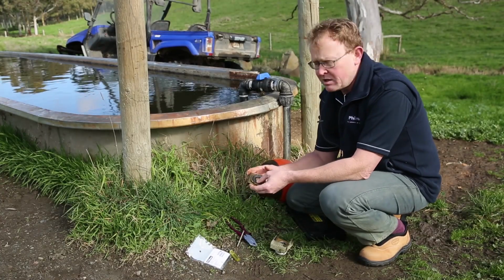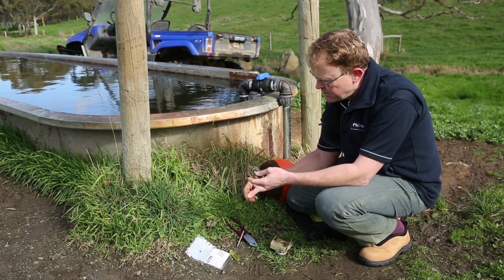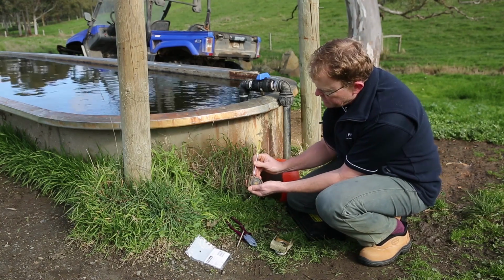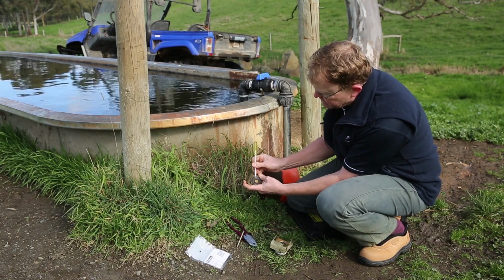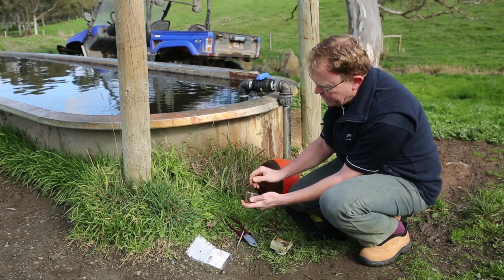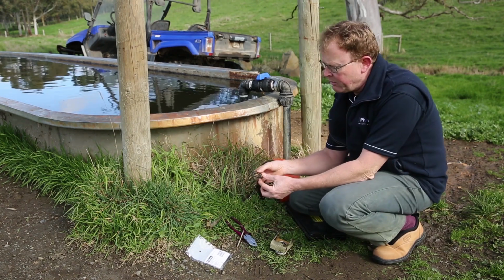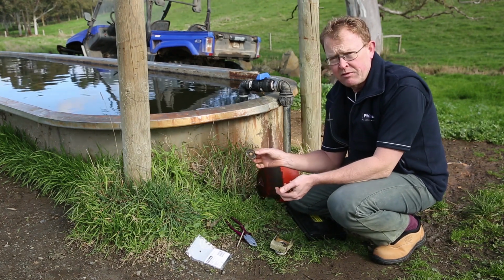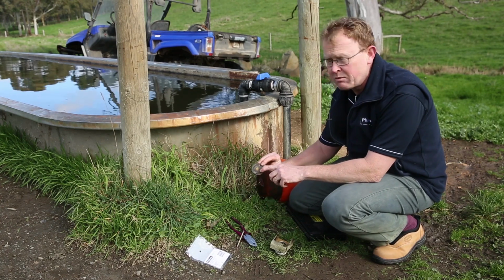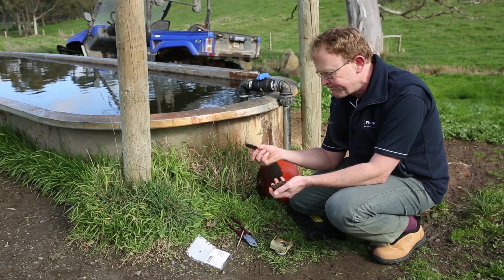In terms of the seal itself, you can see there it's kept inside this housing here. Very simple to remove. Simply a question of taking a screwdriver, and you can see there I actually get in under the seal itself, just waggle that in and lift it up there and simply remove it. Now we can do one of two things today. We can either reuse this seal, and yes, Philmac seals can be reused, simply by rotating it. So if this surface here was damaged, simply flip it over. I've got a brand new surface, I can reuse it.